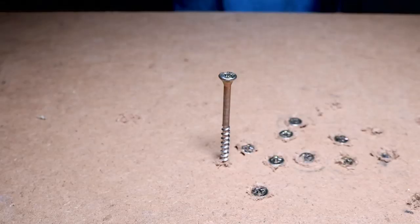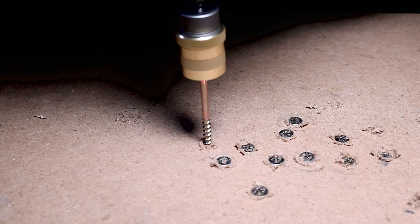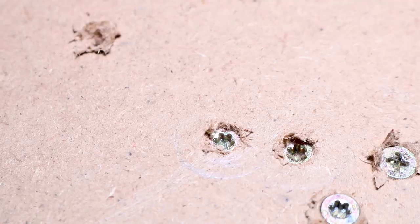Now I do not have to worry about going any deeper than that if I didn't want to. However, if I wanted to go even deeper — around a quarter of an inch max — I could do that and sink every other screw to the perfect depth. This will not only prevent your work from splitting, but it'll make it look uniform as well.